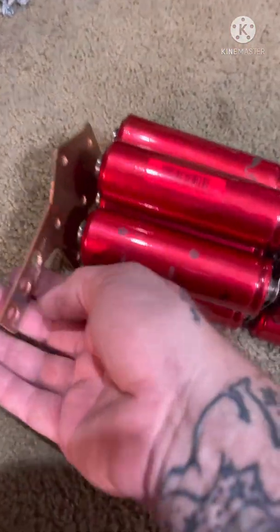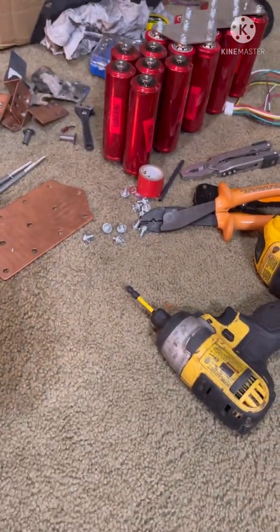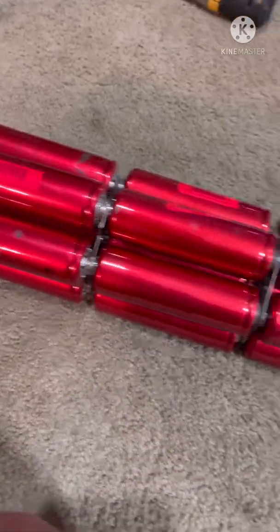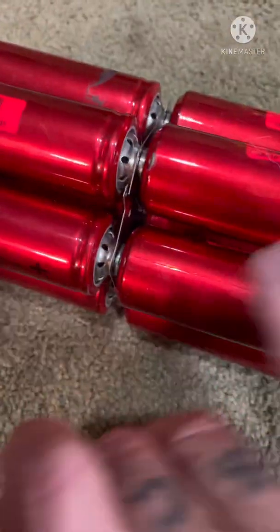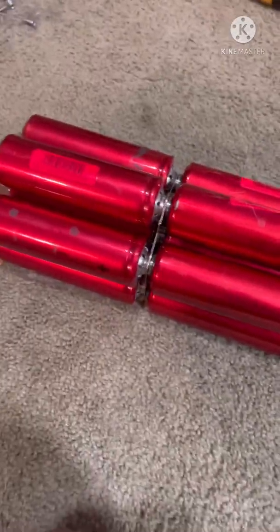I took the end plates that were on there — they fit perfect. I just drilled holes in them and I'm going to mount these on here, which gives me somewhere to mount power wire and ground wire. I'm getting ready to put the balancer on it right now. This is pretty ingenious — it was a last-minute thought, and it's the easiest way to build a 48 amp-hour bank out of a Super Beast module. The cells were already put together with those plates keeping everything connected, and it worked out perfect. About to finish this up — peace out guys.